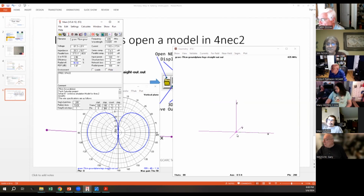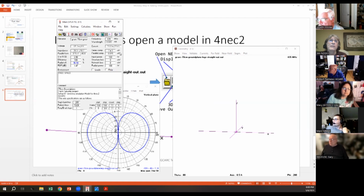You can create a matching network if your heart's set on it. In fact, the software here, I'm glad you brought that up, tells you that if you wanted to create a matching network, it's actually telling you how many microhenries in series or parallel in order to help you build such a matching network if you wanted to. Yep, that's pretty advanced. Anybody else?